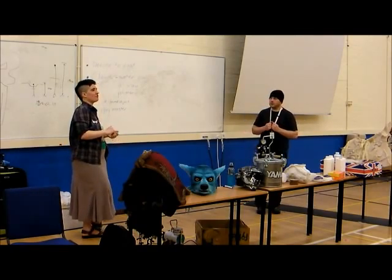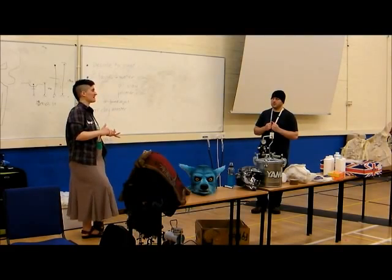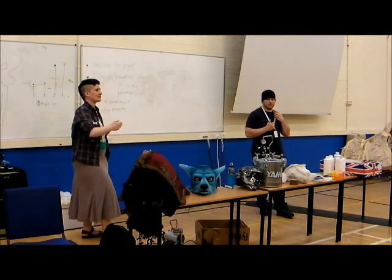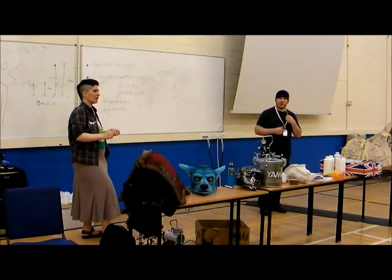There's something they don't tell you, that you can also work plasticine with oils or solvents. My favourite is actually cooking oil. It's not ideal for a good surface, but it will give you a little bit of slickness so that you can smooth it out a lot more. A heat gun to keep it hot.